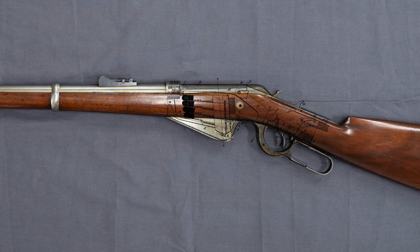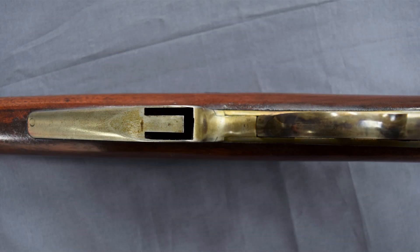If we overlaid the original patent over the rifle we can get some idea of how it actually worked. The rounds were pushed up into the action by a follower arm which was actuated by a V spring located in front of the magazine housing. The bottom of the fixed magazine has a cutout corresponding to the clip to allow it to fall or to be pushed clear by a new clip.